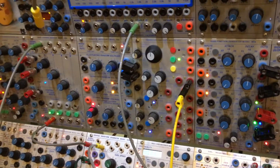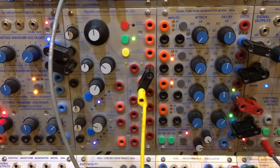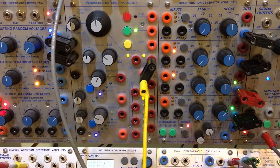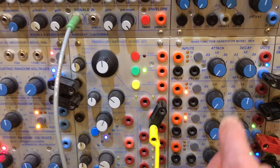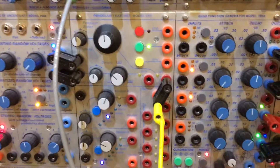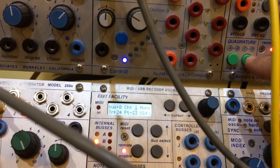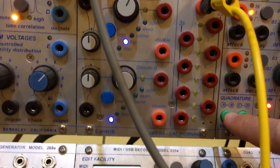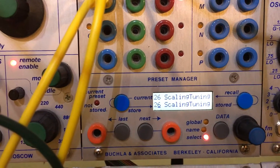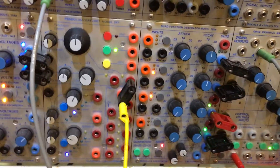I have two 281Es in my system. This one on the left is set to D and this one is set to A. To check, it's different than most other Buchla modules in that you don't use remote enable — you use the quadrature buttons to check each processor, because there's a processor for every two generators. Jumping down to our preset management window, pushing quadrature CD we get A2, pushing quadrature AB we get A1. So we know the ID is set to A on the back, making it A1 and A2, and now it's listening to MIDI.